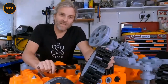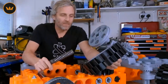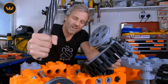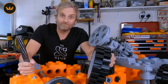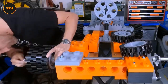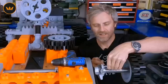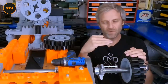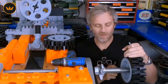I'm nearly ready to spin this up and get it moving, but first I'm going to get these wheels back on and make them fit nicer on the shaft. I've got a 30mm reamer — not quite chuck level — ream them out, get them into place and hopefully get this motor moving. They are fairly cheap hubs and just not tapped terribly straight, so the bolt goes in at a little bit of an angle. I'm just going to run a tap through it, and if that doesn't work I'll open the holes up a little bit further.